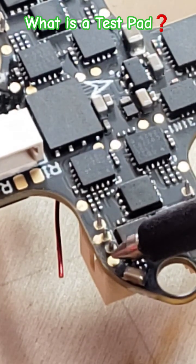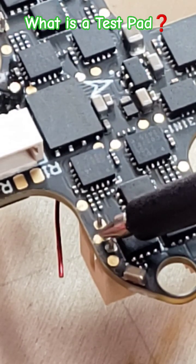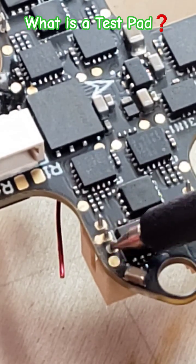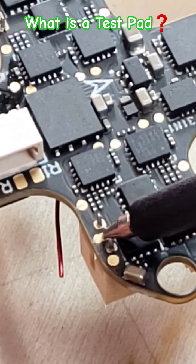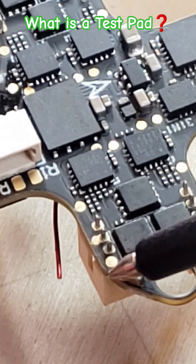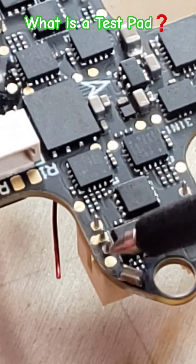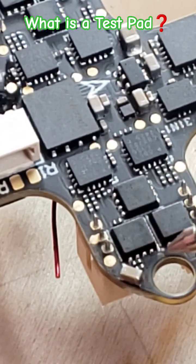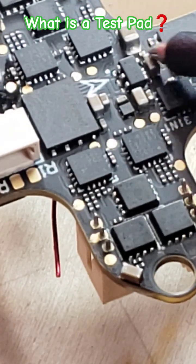If you were to bridge a little bit of solder between these two pads, or bridge solder between the center pin and the test pad, that's fine. Obviously it's too far away to bridge from one end to the other, but bridging these two right here is fine. However, if you bridge between any of these other two — the pad and pin with that pad or pin — that's a problem. You can put lots of flux on here and wick away any solder bridges, but a small bridge between these two should be totally fine.